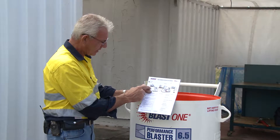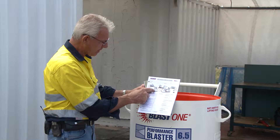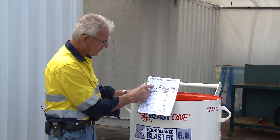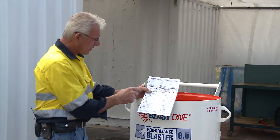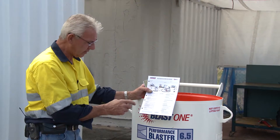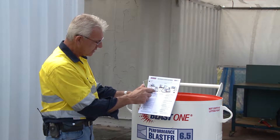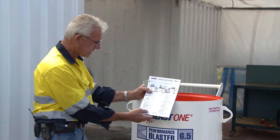Predominantly what we do is have one compressor large enough to operate our after cooler or air prep, large enough to operate a blast pot as well, and we'll also plug our breathing air into that one compressor. It's important to know that your compressor is large enough to do the job, and as we go through this whole process we'll help you understand what is required to ensure you have enough air to facilitate a good outcome in relation to blasting.